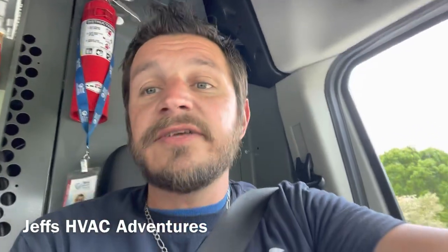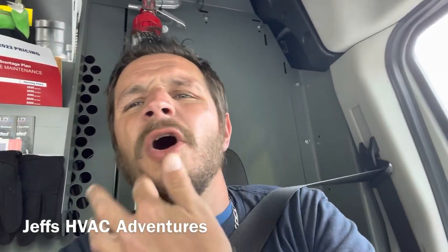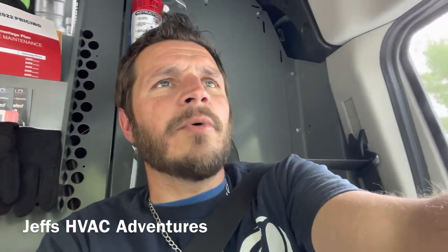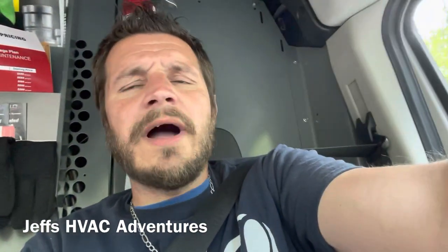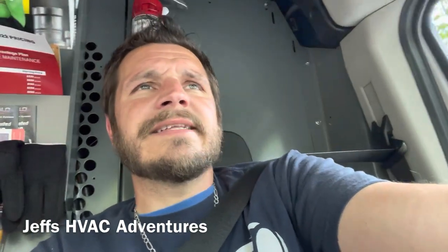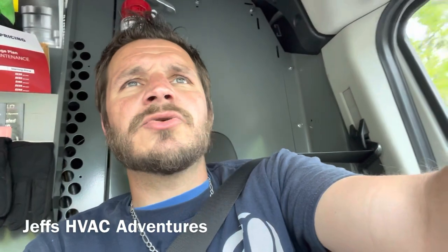Especially those Carrier Payne Bryant units, they rub out all the time. I see that all the time. And hindsight always being 20/20, I probably should have started there, but I wanted to do my due diligence because the unit started and it ran and didn't trip. And plus all those wire nuts in that air handler and the outdoor unit, they looked real crappy. So it did them good to replace those also. And just to check continuity, just to make sure we didn't have anything shorted out anywhere else.